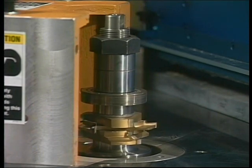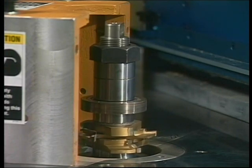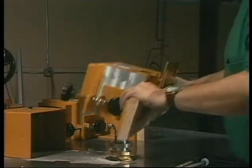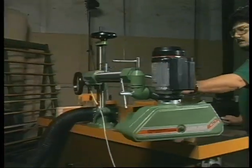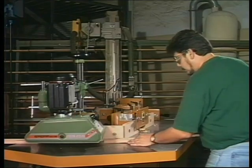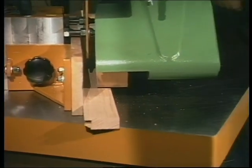After the rail arches are machined, remove the arch template system and the quick-change dust hood. The spindle is then adjusted to the lower setting for accurate alignment with the table. The quick change back fence assembly is installed at a preset machining position. The center mounted power feed system is then rotated into position and the remaining sticks and rails, regardless of length, are machined quickly and safely with a consistent finish using the power feeder.